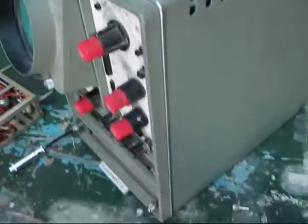It's made by Telle Equipment in England, and it's supplied by Jacobi Mitchell & Co., Kent Street, Sydney. I just need to get a 1.5 amp fuse — it goes in there. It's just been rigged out with a spring so it still works, but if it's going to be used for testing, it needs a proper fuse.